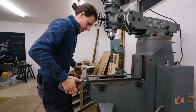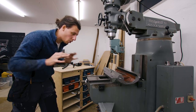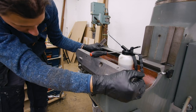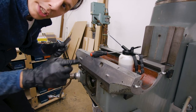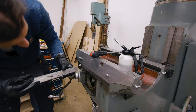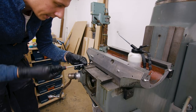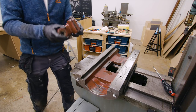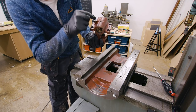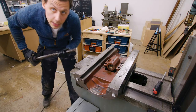First things first, this guy goes on — that's basically like half a mill. I've made sure to apply plenty of oil on all the surfaces that I assemble so that I don't accidentally start scratching things up. With this in place it's still very loose, because normally machine tools like this have an adjustability in the form of a wedge called a gib, which goes in here and is tightened down by this screw. The next bit to go in is this piece with a bunch of nuts. This also does not need grease — still oil. And then the lead screw goes in there.